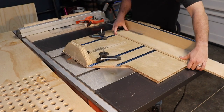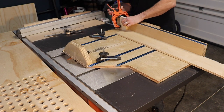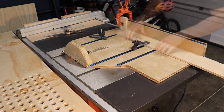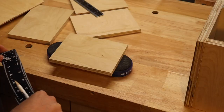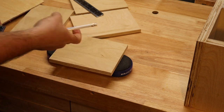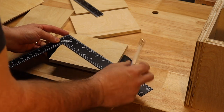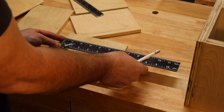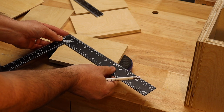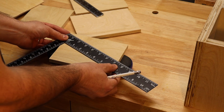Here I'm using half inch plywood to cut pieces for the drawer, which is going to be four and a half inches tall. Next I mapped out where to drill a three quarter inch hole for a finger draw pull. To avoid math, I did a little trick — instead of finding the middle of six and three eighth inches, I angled the square to show seven inches from one side of the board to the other, then marked the middle at three and a half inches, half of seven.